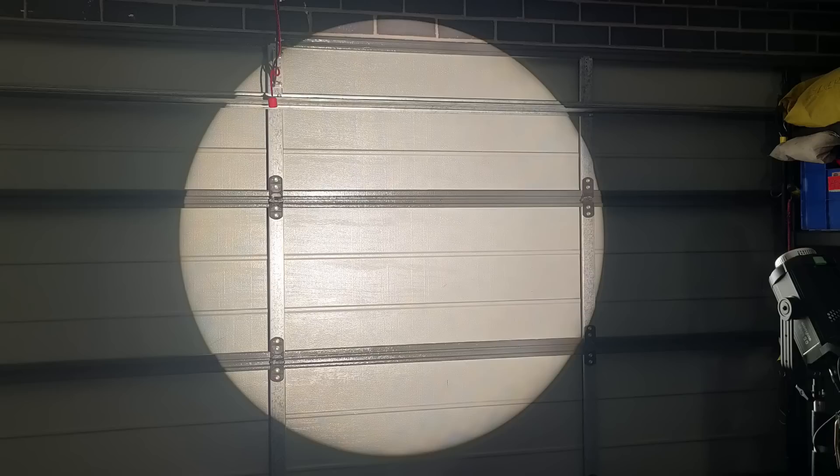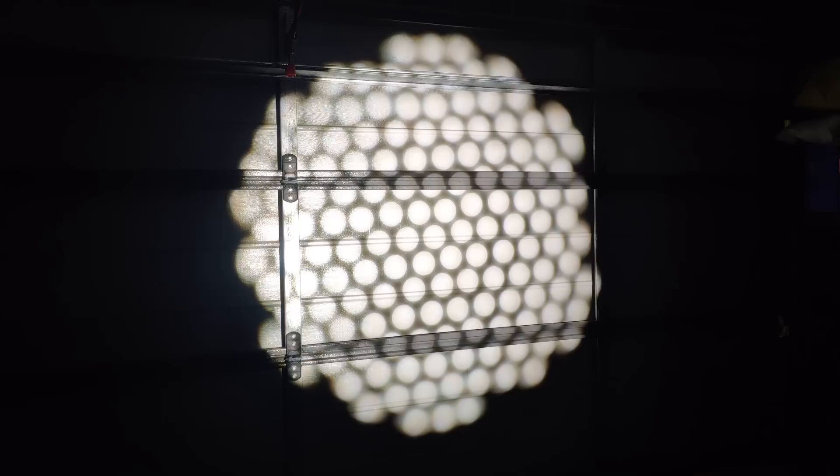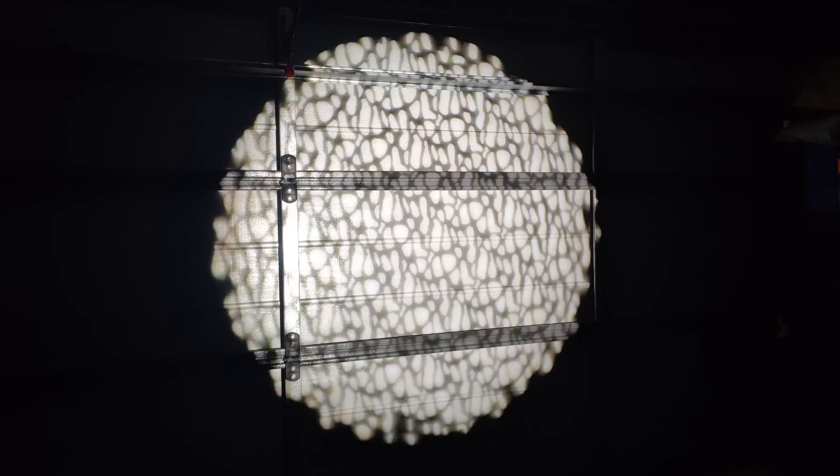Now let's look at how the light performs going through the Aperture spotlight mount. If you're using it for a spotlight effect it looks okay from a distance, but from any close distance you can see it's very splotchy. Even with the focus set to the cutter blades, you can make out the emitter pattern in the overall beam. With gobo projections the blacks are very milky, and with straight linear patterns there's a lot of concaving. You have minimum focusing range before you start seeing the LED emitters. With circular patterns, the difference in focus across the beam is highly exaggerated. Complex patterns look okay but the blacks are very milky, and you don't have a large amount of range for focusing and defocusing before you start seeing the emitter array.